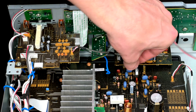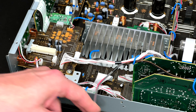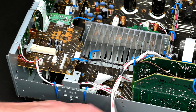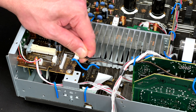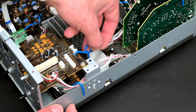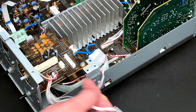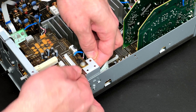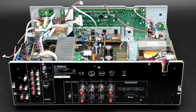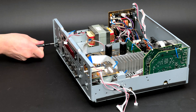Audio signal gets into the main PCB through this cable. This is a service cable — not sure about the exact purpose of it. This multipurpose 13-pin cable carries bipolar 15-volt feeds as well as the audio signal. This is the audio signal branch out for the subwoofer output. That's the link to the microprocessor, followed by the input selector knob, volume control knob, and the last ribbon cable which goes to the front PCB. After all cables are disconnected, all is left is to undo three screws and the sub-chassis unit is successfully extracted.